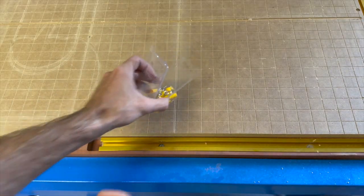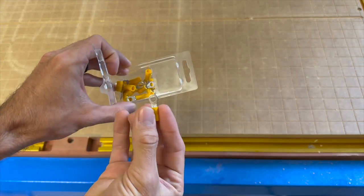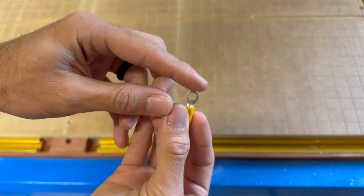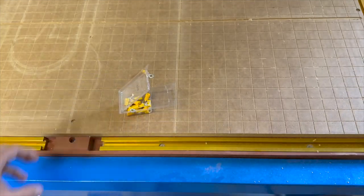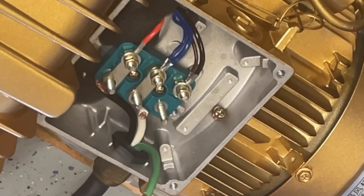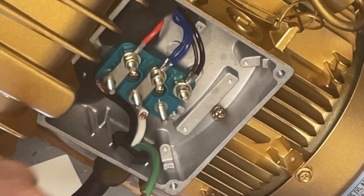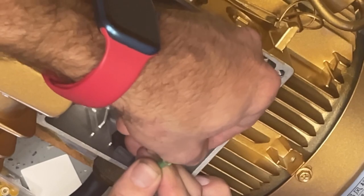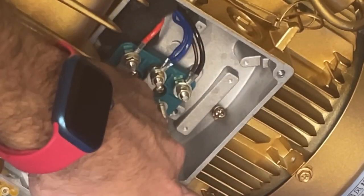You're just going to feed your cable in with a little twist lock connector on the outside. You are going to need a pack of these yellow ring connectors. The yellow is for 10-gauge wire, and if you're using 10-3 like I recommended, then these will fit your gauge of wire. It's going to have a circle on the end so that it slips right over the nut and the bolt. You can tighten it down. Go ahead and slip these connectors right over the wire, take a good pair of crimpers or wire cutters with crimpers, and crimp them down nice and tight.